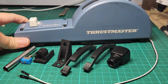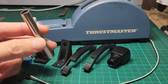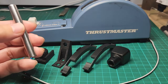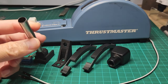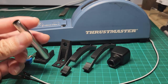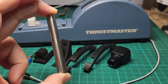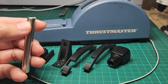So what are the things we need for this mod? First of all we need this tube here — it's called a chrome tube or a brass tube plated with stainless steel or chrome. It needs to be 9 millimeters in diameter with a thickness of 0.5 millimeters. You need about 50 or 55 millimeters of this, and of course that depends on how long you want the new handle to be.